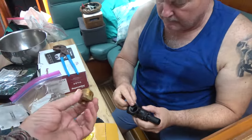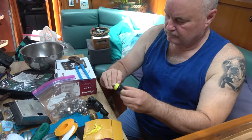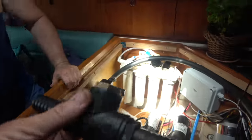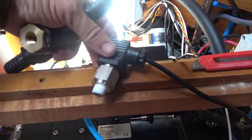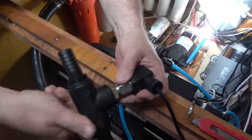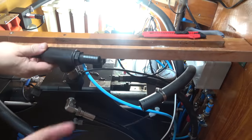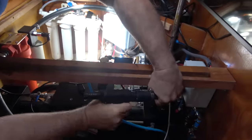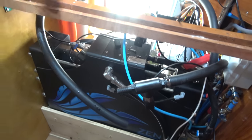We need to put good Teflon on both sides of the brass adapter — the inlet and the outlet. There's our prepared tee fitting: the brass and everything has been Teflon taped, everything is tight and ready to go. We've put Teflon tape on the fitting itself and the pressure switch, so now you can just twist it on and tighten those together. Now we can install that into this line, and we can shorten that line a little bit as well.